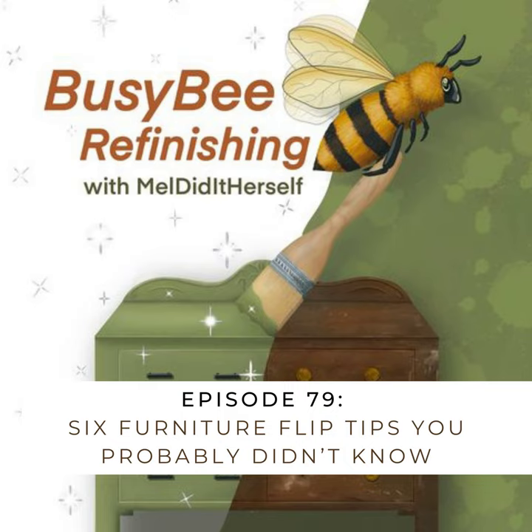Has there ever been a time when you've broken up your process into a couple of days — cleaning and repairs one day, sanding the next, then staining on day three? I would recommend that going forward, you always do your final sand right before you go in with that finish, stain, or top coat. When you leave it overnight, those wood pores are going to close up again. Leave that final sand for the following day, get the dust out, and then go in with your next step — you will get a much smoother, more uniform finish.